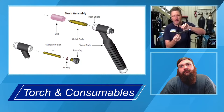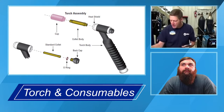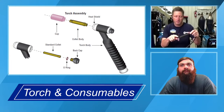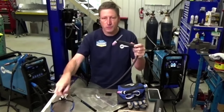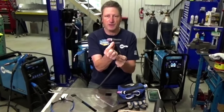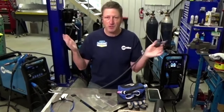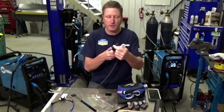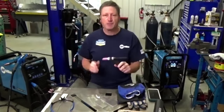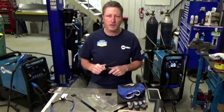There are different sizes of back cap available. This is a full-length one, which holds a full-length piece of tungsten all the way up the back cap. However, there are other ones available — like a medium one or a flush cap. Andy prefers using the smaller back caps so there's less that could get hung up on something while welding, especially when deep in a car trying to do something where that big long back cap gets in the way.